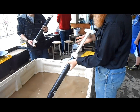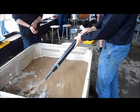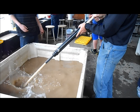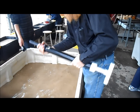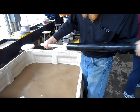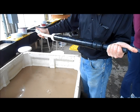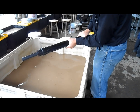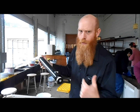Here's a good plunger. It sucks and shoots nicely. You pull all the way back — nothing shoots out the top, nothing is coming out there. To check the suction, you plug it off and pull — basically can't pull it. It's a perfect seal. Push it — you can push a little bit but not very much. It's sealed inside there. That's a good plunger. Once it's glued, that cap won't pop off.